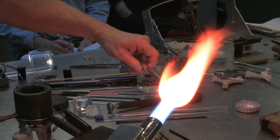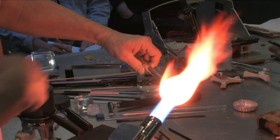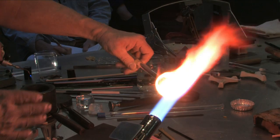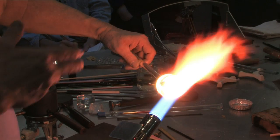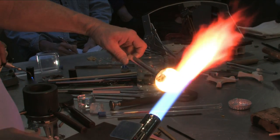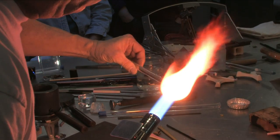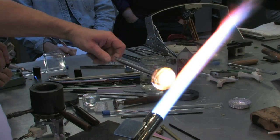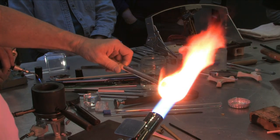If I heat it like this into the face, this is the glass that's going to meet your flower anyway. So this is the stuff that has to be hot. The back stays cold and solid. That allows me to get that front crazy, crazy hot. And that's what we're looking for. Is a white orange, I would imagine 2300, close to 2300 degrees. I mean, very, very liquid.